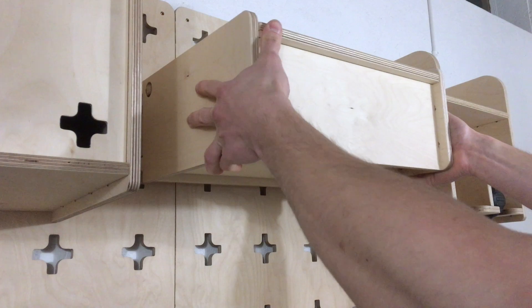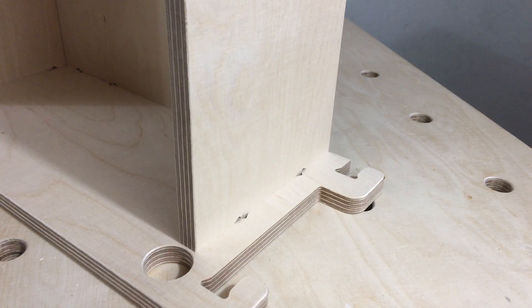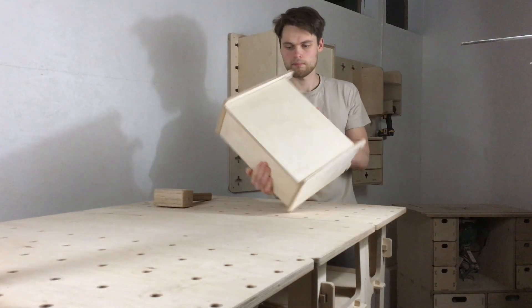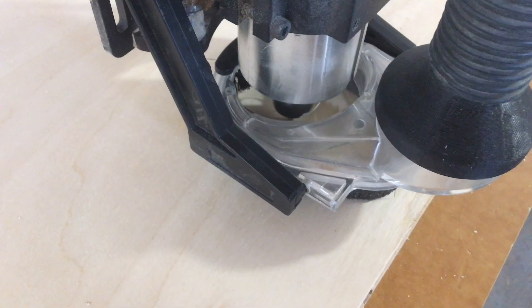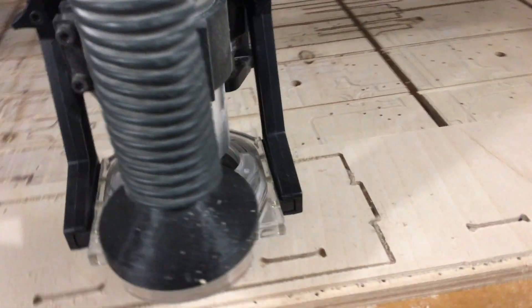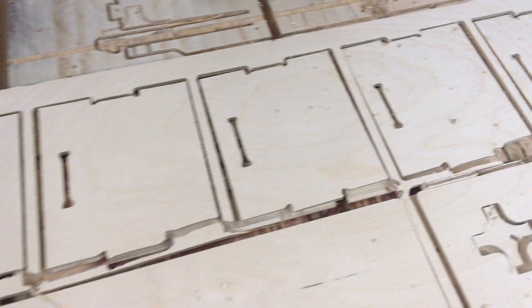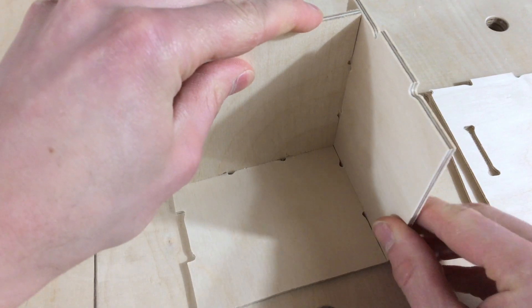I had to have an attachment for storing and sorting my screws, dowels and other small items — for that, small boxes would be perfect. But I didn't want small attachments scattered all across the panel, so I made a bigger box with enough room for six of the smaller sorting boxes. The large box had a lid to prevent dust from collecting. When cutting the components on the CNC router I made a horrible mistake that ruined half of the small box components — I thought it would be faster to skip the support tabs, but since the plywood was only 3mm thick, the components moved during the cuts and the result was terrible. Some joints were messed up and there were router bit marks on many components, leaving me with only 3 out of 6 boxes.